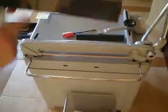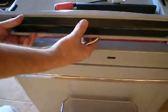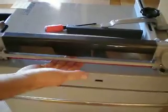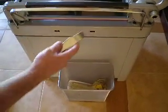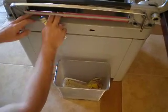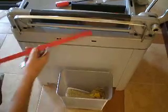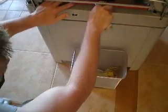I'll show you how to change the cut pad. With the blade all the way up, use this tool — you can see the arrow on it pointing out. Put it under the edge of the blade and snap it in place so the blade can't come down on your hand. From there, use the tool to push into this hole and it will pop the cut pad up. When you're reaching in to get it, you won't cut your fingers. There are four sides to the cut pad, so you can rotate them — each side lasts a long time. Just put it back in and push down and it snaps into place.